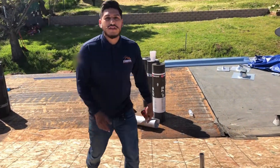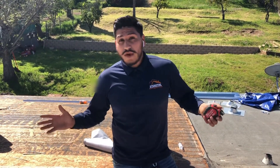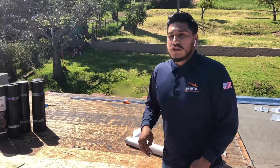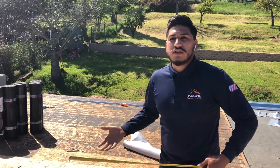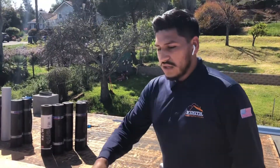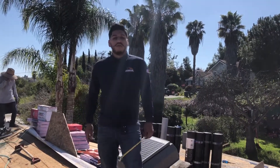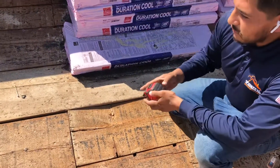It's not going to go into a seam or anything like that. Now, you are adding a little bit more weight onto your roof. This roof had two layers of shingles, and a roofing square is about three plywood sheets, so you're looking at 210 pounds — you're not really adding that much weight. If you had two layers on your roof, it's always better to just go over these planks. Whenever we see planks, we always include doing an overlay of plywood.